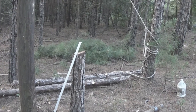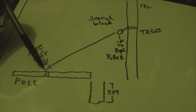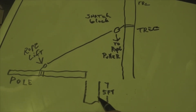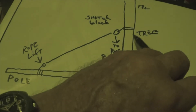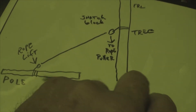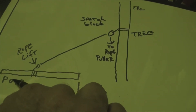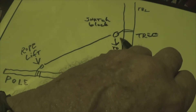Here's the first of the white papers. We have our pole, which is this — this is what we're going to stand upright. We have our lift point approximately 50% from each end. We have our hole, which is 5 feet deep — that's going to meet standard. On this tree, we're up about 22 to 25 feet. The reason being is because we may have to pick this pole physically a little bit up to set it into the hole. The pole is 20 feet long, so it's about 10 feet from here to there, so this needs to be just a little bit above that.